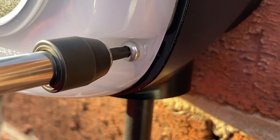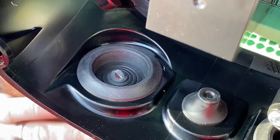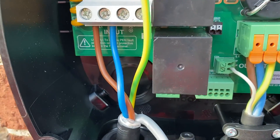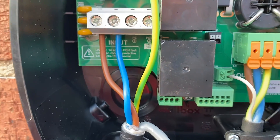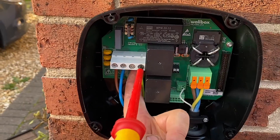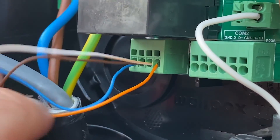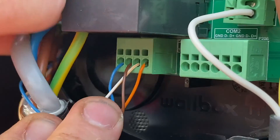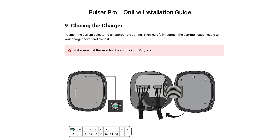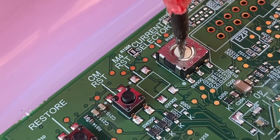Removing the cover, we take the ribbon to the front of the charger off and we can start by getting our cable fed in and connected into the terminations. Be sure to connect the CPC into the PE2 terminal, which is for PME supplies in the UK, as the Wallbox Pulsar Pro comes with PEN fault protection built in. Those connections made, we can terminate the data cables which communicate with the clamp power meter back at the mains end. Finally, we make the correct selections for the EV charger - important to have the installation guide at hand.